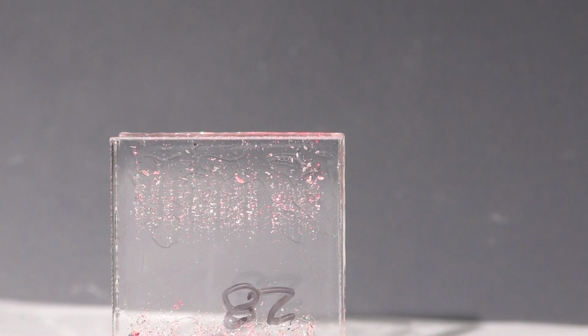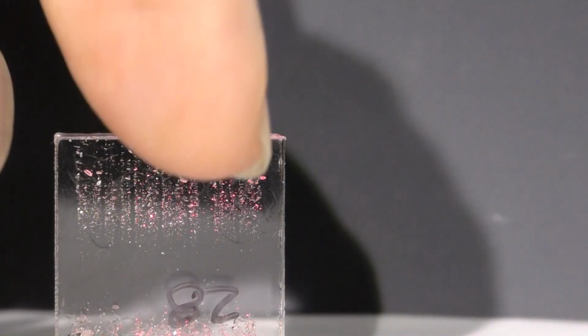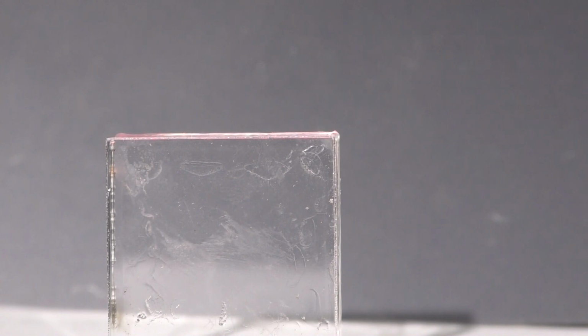As you can see, we've dropped it down into the material. There's no doubt it's focus related. The one at the bottom was 3 millimeters high, and the one at the top here is 3 millimeters low. So this time we'll have a go at reducing the power. We've got a fixed pulse width of 45, and the last time we did this we had just a little bit of crackle and pop on the surface. So we'll reduce the power now to 80%.